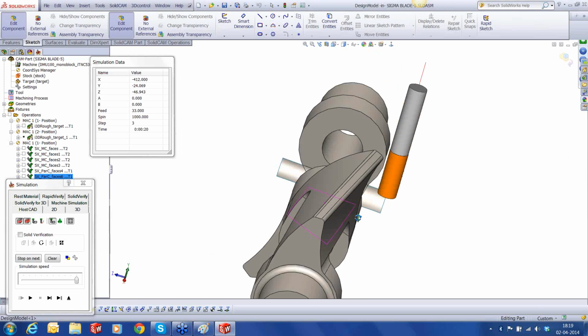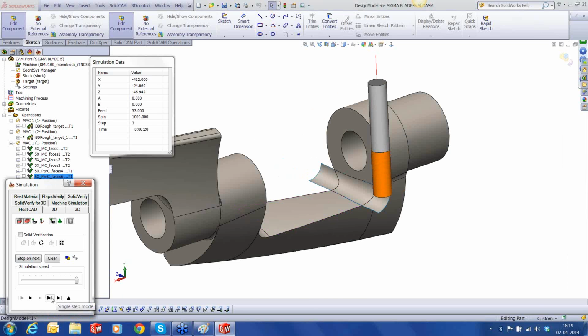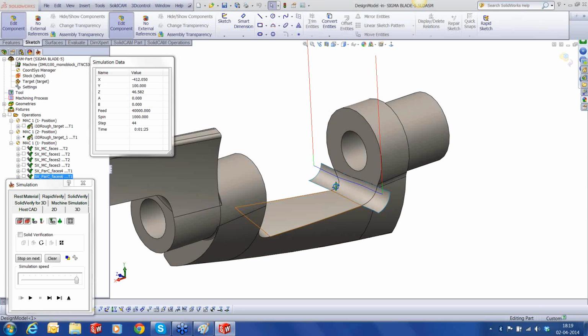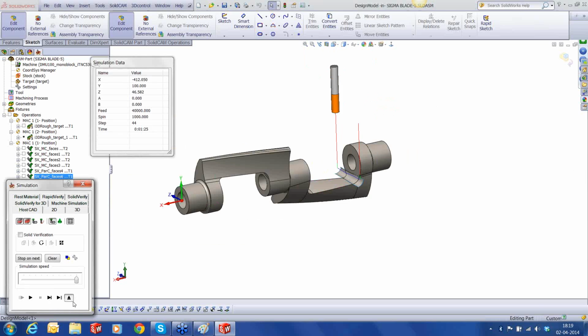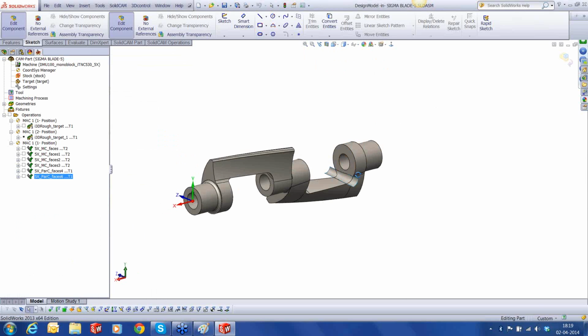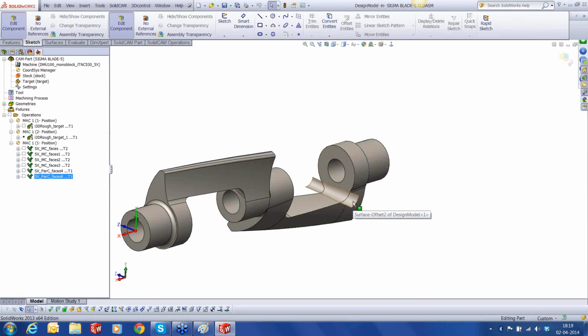It's out of that surface, so the entry is outside. And it nicely cuts the surface, the side, using the side of the tool, leaves the material, climbs out. So rather than sticking on to the surface out there, what we did basically was just to use a bottom surface, the curve, and machine that curve so that it cuts exactly that surface on the side.